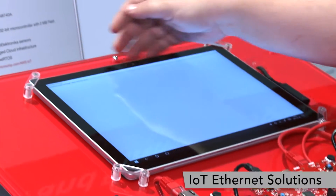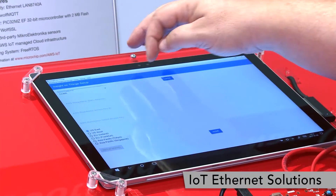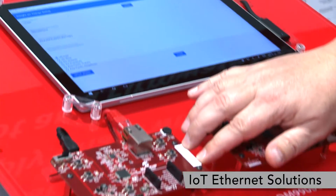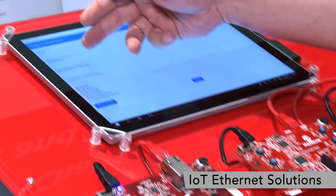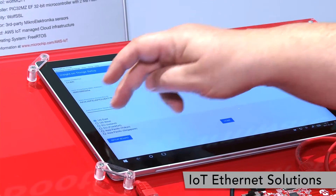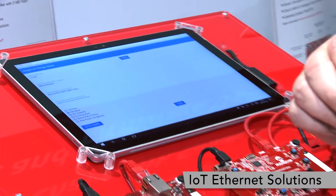To do that, I will hit the setup button, go down, and select the COM port that the board is on. I will open the COM port. It has pulled the MAC address from this board up here, and I've pre-loaded this already with admin level keys for AWS. Here I'll select AWS West because that's as close to this event as I can get.